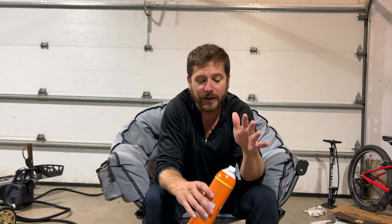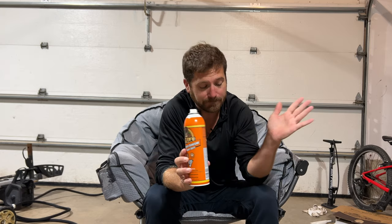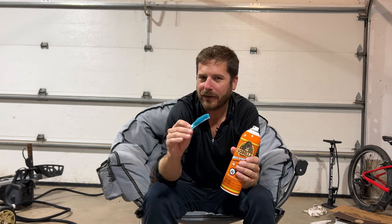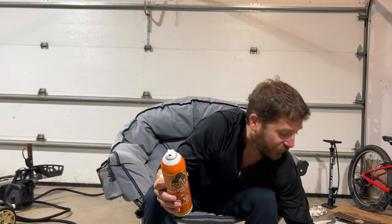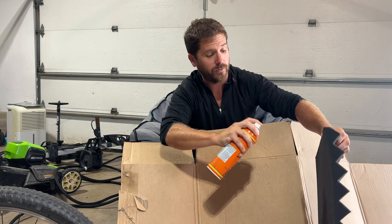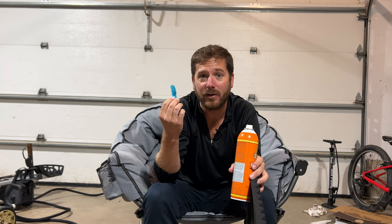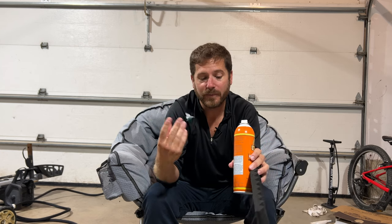We changed locations because the easiest and cheapest way to install acoustic foam on your wall is to use spray glue. But you're probably wondering: if I use spray glue, isn't it going to damage my wall? Yes, it will — it'll completely destroy your wall and you'll have to scrape it off if you ever want to remove it. If you ask Google how to install acoustic foam, it'll tell you to use spray glue directly on the wall, but what they don't tell you is it leaves a huge mess and you'll be disappointed if you need to remove it in a few years.